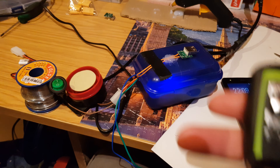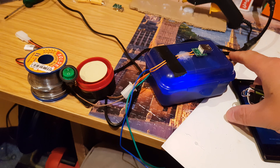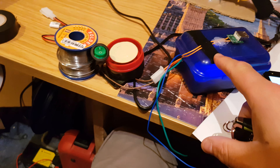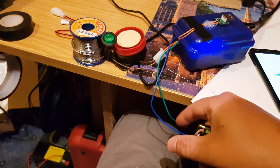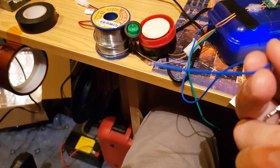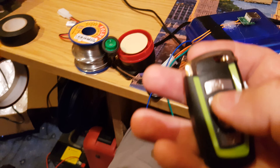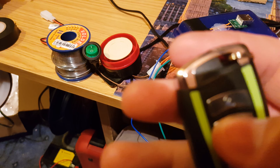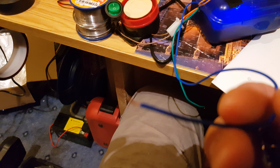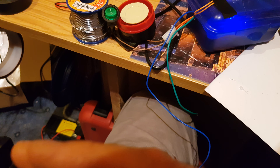I've got a motorcycle alarm kit inside this box. This is where the 12 volt signal comes from — well, it's 52 volts in, stepped down to 12 volts in here. It's about £3 for the step-down converter. The green wire is the aerial for the transmitter. Whenever you click this button — the remote button — you can hear the relay clicking, and it basically sends a pulse of 12 volts through this wire. So what you need is a latch relay, and basically it'll switch over to power on or power off by a 12 volt pulse.